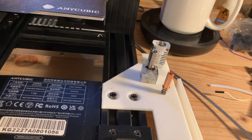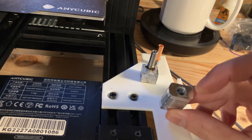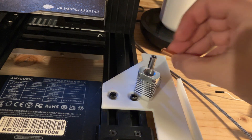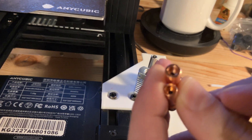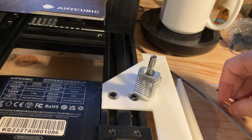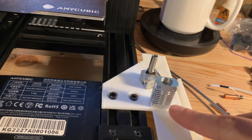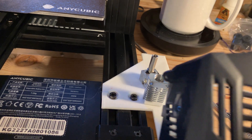There's a lot to this. First, this is a unique heat sink — I found no other heat sink with a specifically six-millimeter diameter throat for the heat break to fit into. The general issue is that this heat break's diameter is much thinner than a traditional Ender 3 style heat break, so heat rapidly runs through all of it, heating the entire section up. What's happening is the heat transfers to the heat sink as it should, but there's not enough time for the heat to dissipate in such a small bit of metal.